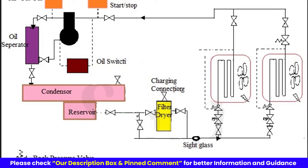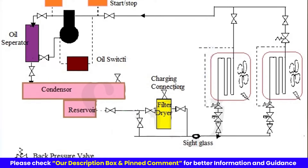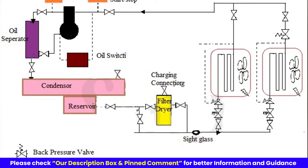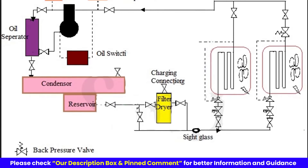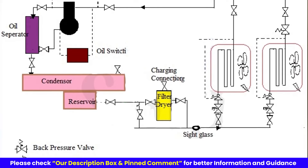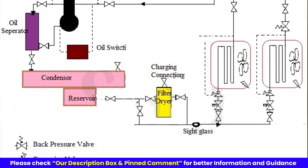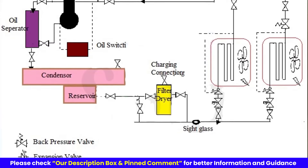The TXV is different, that's okay. But if the system is common, the suction and discharge pressure of the compressor is the same. Suction pressure decides the evaporation temperature. So the pressure in the evaporator — the meat room, fish room, veg room — is decided by the gas pressure. If the gas pressure is low, temperature is low; if high, temperature is high. So the back pressure valve is there to keep the gas pressure in the vegetable room evaporator at a high level, around 4 to 5 bar.